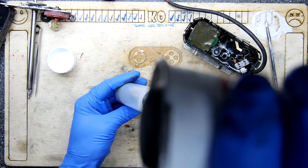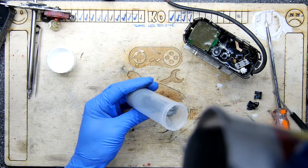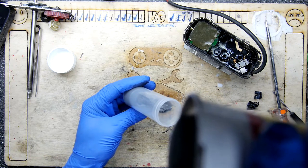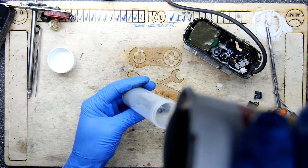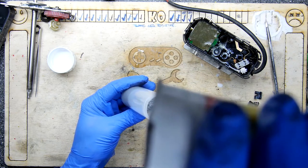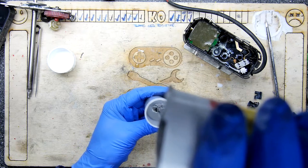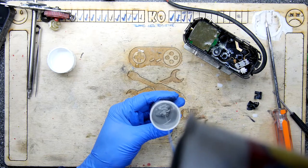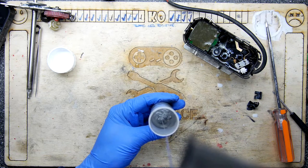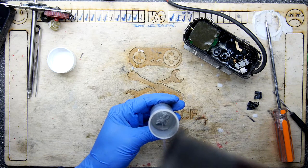I'm tilting it at an angle to make sure air doesn't get caught underneath that gear. If you get air bubbles included on that gear, it's going to be a nightmare when you demould — though if there is an air bubble and you resin it, you'd have too much material but you could always file that off in the final version. We're getting to the limit of the silicone I've mixed — I'm starting to run out — and I'm not quite covered the shape, so I'm hoping we're going to have just enough to cover it. Yes — hooray!